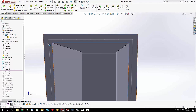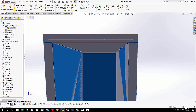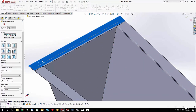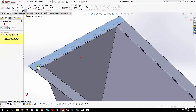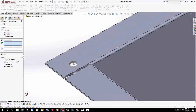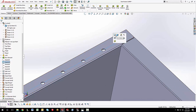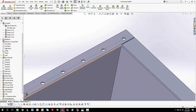Finish out of the sketch. I'll hide the other sketches and go back to the end of the part including the flat pattern. I'll hide the main part, rotate to the back side, then do a Hole Wizard — regular hole, one inch — and position it at that point. Then I'll pre-select that sketch and do a Sketch Driven Pattern using that hole feature. Anywhere there's a point it places a hole. I noticed I forgot the point on the end, so I'll edit the sketch, add a point there, finish out — there we go, looks good.